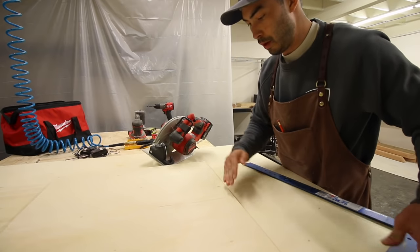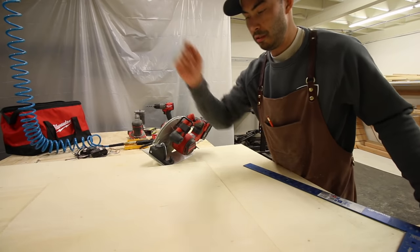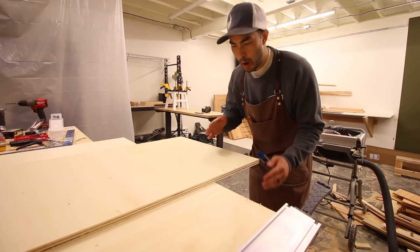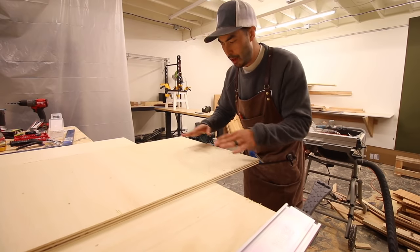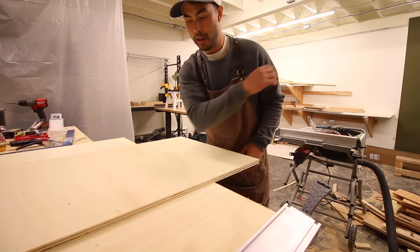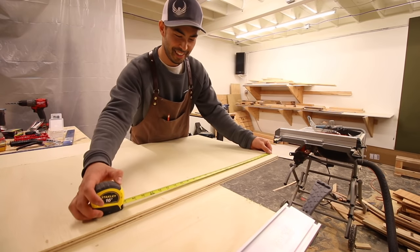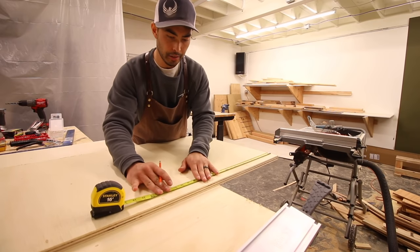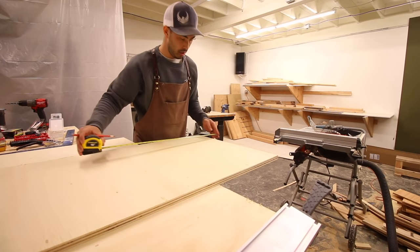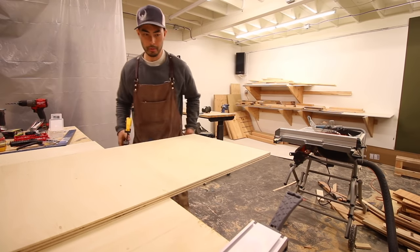So I know that line is directly perpendicular to this line. Once again I take an inch and a half up off of this cut, throw on my straight edge, and lop off that edge. Now I have three cuts that I know are all straight, so I can measure from this side 18 inches and cut the body parts. We're going 18 inches up here and marking at 19 and a half for the straight edge position, the same thing on the other side.